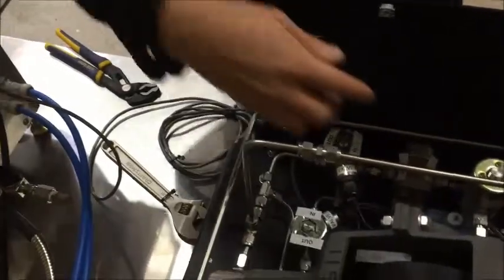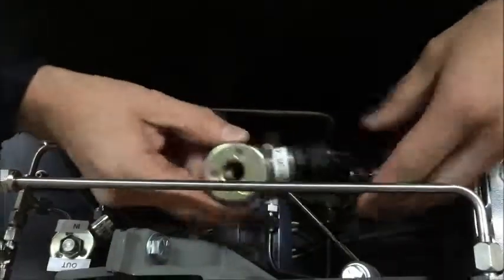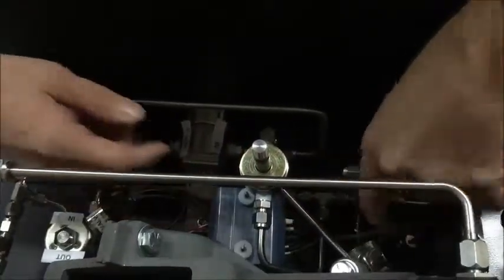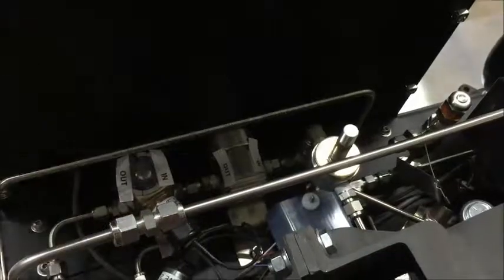You won't actually be disconnecting any of this electrical stuff. After you take that nut off, this piece comes right off — just like that. So you don't actually have to disconnect any wires, just set this off to the side. Then use the wrench that we send you with the system — nine sixteenths. We have a little pressure on the system, so we'll let that bleed off.